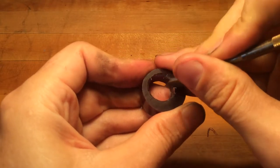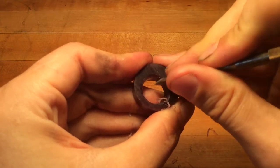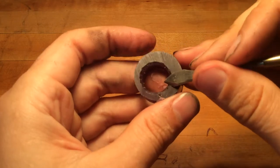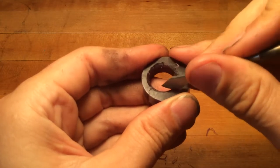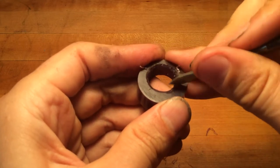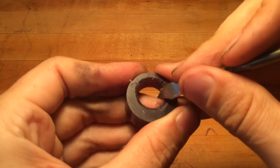Occasionally, if you've been too aggressive in your carving, there's something called chatter. As you're going across you can see there are little chips and dings in the design that don't work. There are ways to relieve the chatter by just changing your angle to a smoother section and then gently working it in and shaving it down. That gives you a little more control, and then you can also try to carve it out.